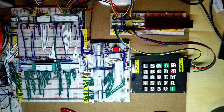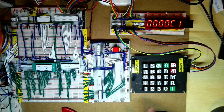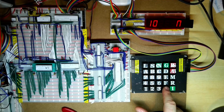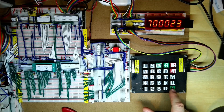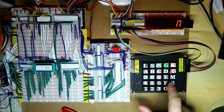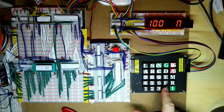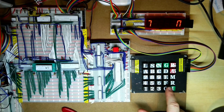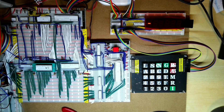Turning on the NanoComp to see if it's working - we've got the dash prompt. Checking some memory: going to the base of memory putting 00 in there, going to memory 1000 putting 01 in there, going to 7000 putting 07 in there. Going back to verify: base has 00, address 1000 has 01, address 7000 has 07. Memory is working, ROM is working - looks like I've managed to plug most things back in correctly.